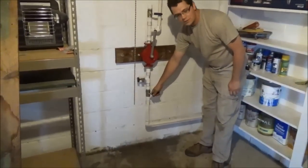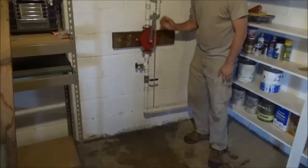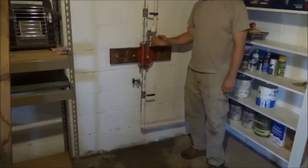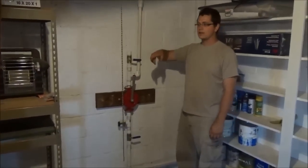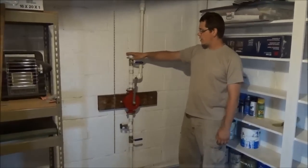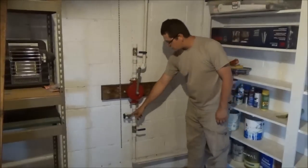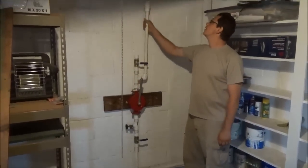We're not going to pump it right now because we just disinfected the well. But if I wanted to, I just hit this valve and start pumping — it just goes back and forth like that. It's real easy to pump, and it'll pressurize the system. It's got a fill port here. These pumps need a little lubrication from time to time, so you can add a couple ounces of mineral oil.